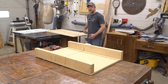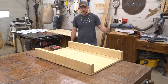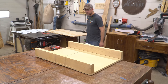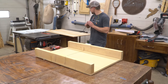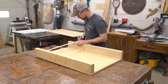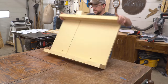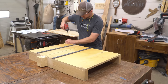The next thing I need to do is square off one side of my big panels and then cut them to their final length. Normally I would do that with a straight-line guide with my track saw or circular saw — a poor man's track saw. I just wrecked the only good blade I had in my circular saw and I don't trust it to cut this without destroying it. So now I'm having to backpedal. The nearest new blade is 20 miles away, so I'm just going to try something else. This is my giant cross-cut sled. 24-inch panels don't fit into a 20 and three-quarter inch space very well, but all of the squareness comes from this back fence. The front fence just adds strength so your two halves don't get floppy — if you're careful you can use it without it. So I'm going to dismantle it.